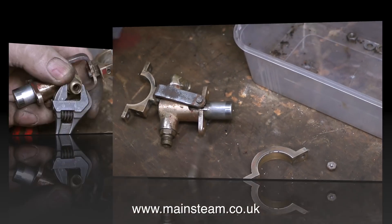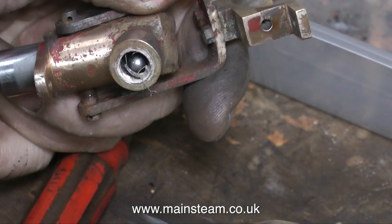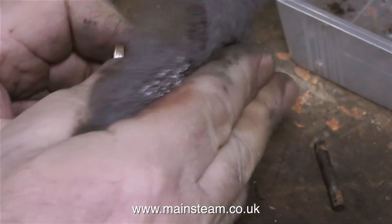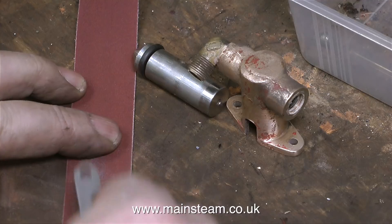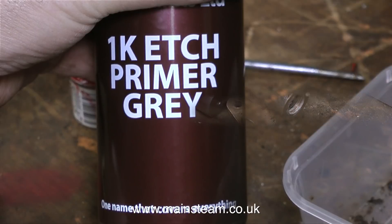The second pin's come out. Before I paint this pump, I'm taking off this union, and you can clearly see the stainless steel ball in the valve chamber. I removed this and put it in a safe place for later. The rusty cross pin was very tight in the ram, but I managed to tap it out very carefully with a hammer, and in this clip I'm starting the process of cleaning up the metal parts before painting.